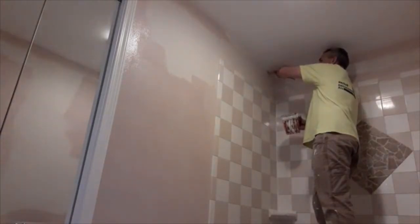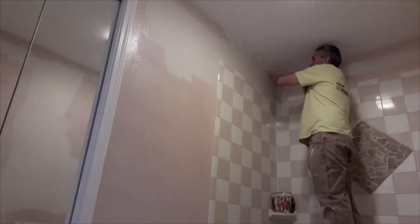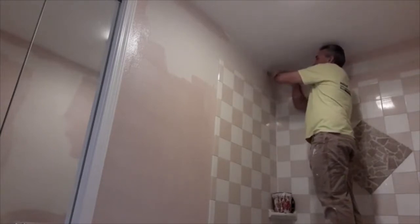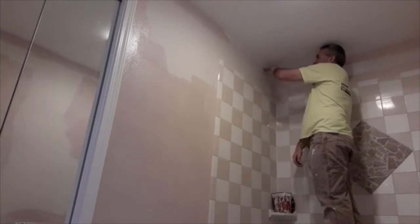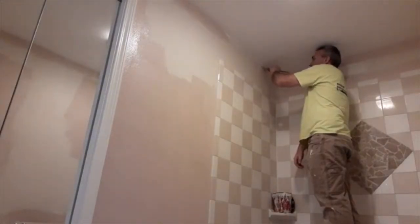And I'm just looking just ahead of my brush. So I always give it a wipe down a little bit lower so I don't get the extra paint up on the ceiling. And I'm just keeping my eyes just in front of the brush there. Coming right across the ceiling. Sometimes you get holes from the texture. And I'll just go back the other way with my brush, it'll fill it in real easily.